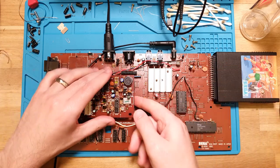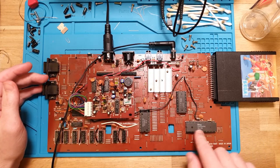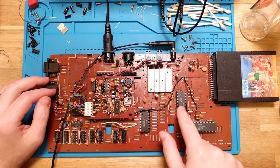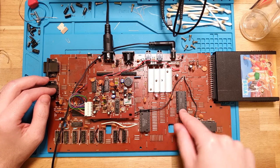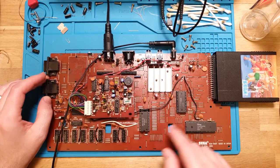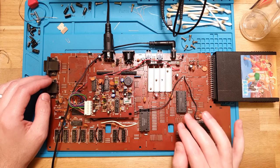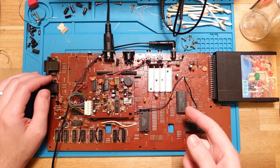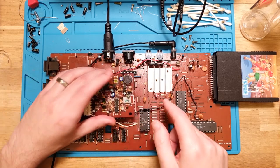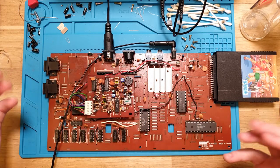This is the Franken-console. This is going to be like the Ship of Theseus with how many chips I'm replacing here. But the one thing that I'm very happy that I haven't had to replace is this, because this Sega MyTech 2 chip is pretty much unobtainium. You cannot find a replacement other than finding another non-working one of these consoles, and they're pretty rare at the moment. Most of them are working. It looks like this chip has a pretty good not-failing rate, but yeah, I'm ecstatic. Replaced the Z80 and replaced the PPI, the IO operation chip thingy. And it seems to be working.